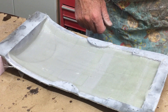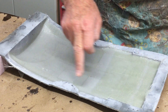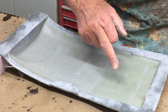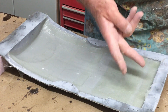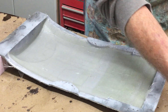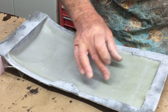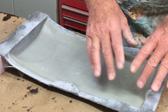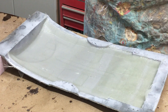It should come out flush once it's done. Then a complete sheet of six-ounce cloth, plus some perimeter strips of about one inch wide six-ounce all the way around just to edge it up and get it stronger. For the speed brake, a panel of six-ounce cloth up to about here — so that's two layers of six-ounce plus a two-ounce. Then three strips across this way where the speed brake is, and a couple going the other way where the hinges actually are, so you end up with basically four layers of six-ounce where it's needed, and three layers of six-ounce in the rest of it, which should make it stiff. If necessary I can laser cut some plywood or put some stiffeners.